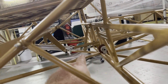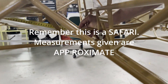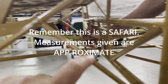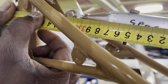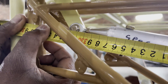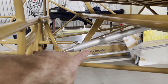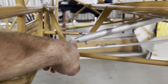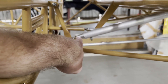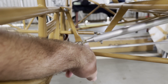We are going to measure the distance from the bolt at the idler to the horn at the back of the elevator — approximately 3318 millimeters. The aluminum push rod comes pre-cut from KFA at a predetermined length. You adjust the length by sliding the end fittings in and out. Leave enough thread for your rod ends — don't go more than four or five threads out — and make sure there's enough material to carry the loads.